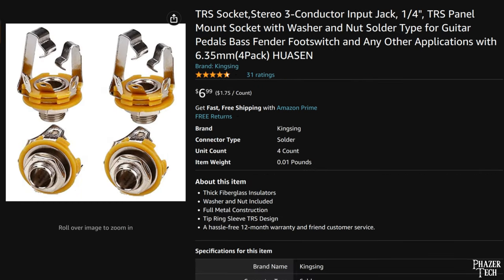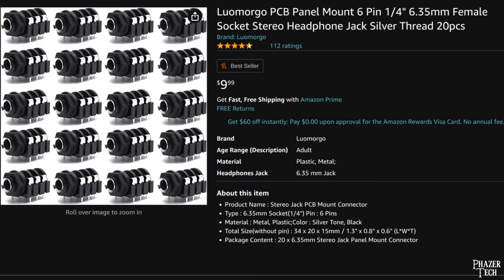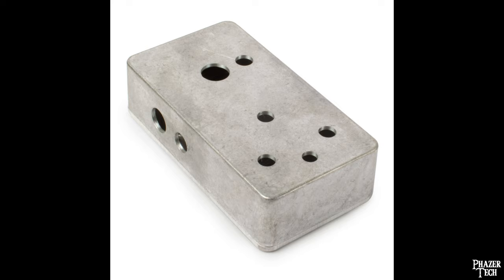Now let's talk about the quarter-inch sockets for the guitar cables. If you're planning to install a battery in your pedal, then you'll want to get the TRS stereo sockets — these have three prongs. If you don't plan to use a battery, then you can use the TS mono sockets. These cheap jacks work fine for most builds, but some of them have misaligned legs that need to be bent a little before they work well, so if you can spare the extra money you might be happier with the premium jacks instead. There's also the DC power jack — you'll want to get 5.5mm by 2.1mm barrel jacks. They come in two styles with the same socket, but the first one requires a larger hole to be mounted. If you're buying a pre-drilled enclosure, be sure to get the correct size power jack.